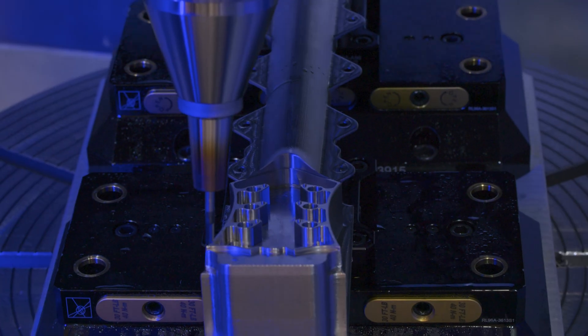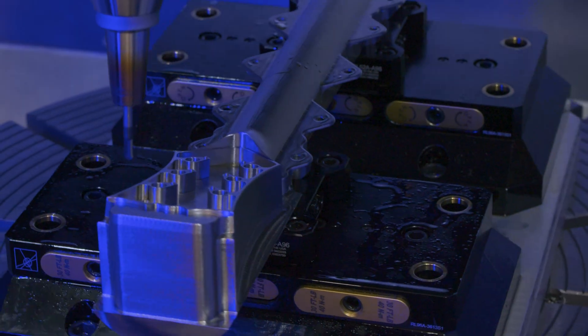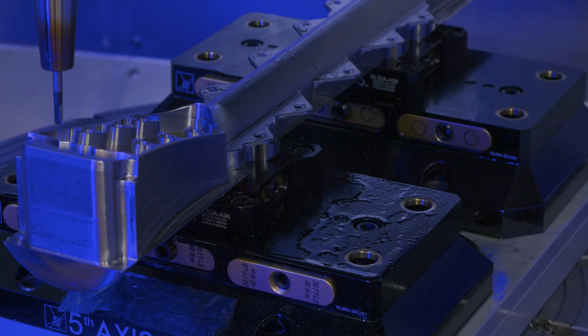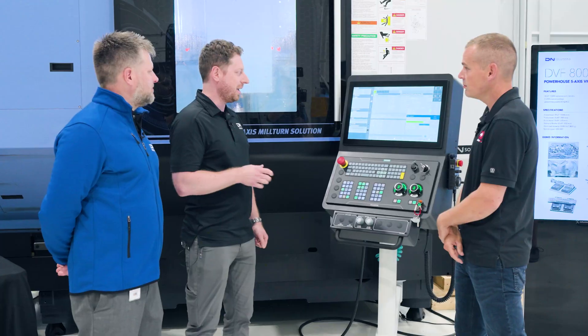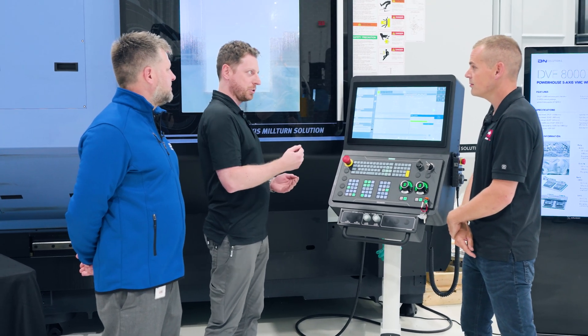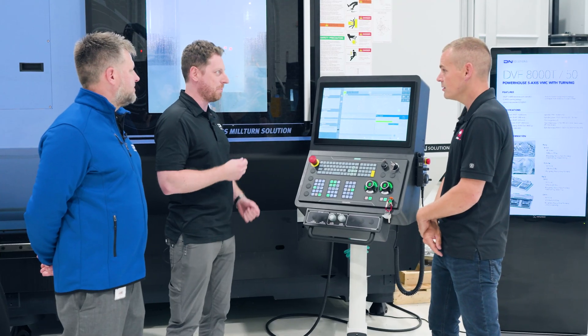Part of this, with the machine running as long as it is, you've got to come in to check on something and interrupt the program. Siemens does a great job with that — anywhere in the cut, you can just pull the tool away. You don't have to be in the air; just pull that tool out. Siemens will let you restart from anywhere with calculations and approach, so you can be confident you're not going to gouge anything and you'll go right back to where you're supposed to be.